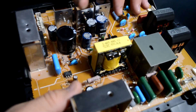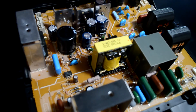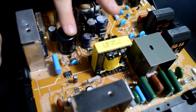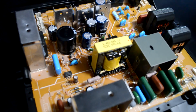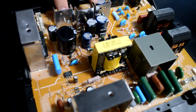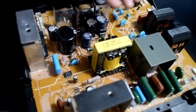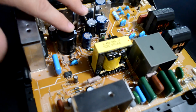Here's the power supply. What we're going to do today is remove all these capacitors. This very large capacitor does feel like it's bowing just a slight little bit, which makes sense since it's from 1996 and it's now 2019 — that's nearly 23 years old. Some of the other ones don't really feel like they've expanded at all, but this larger one does. And I'm going to replace every single one of these capacitors. There are only 13 on this entire board.